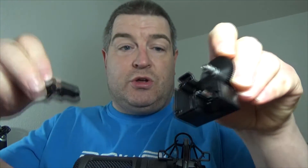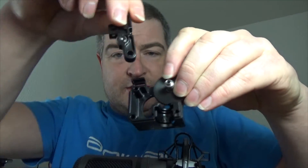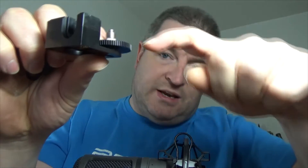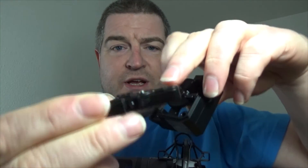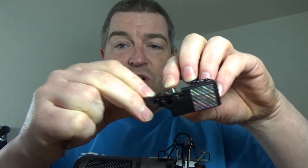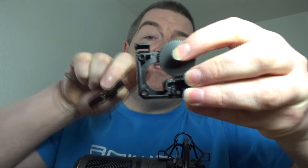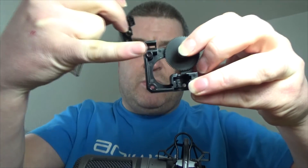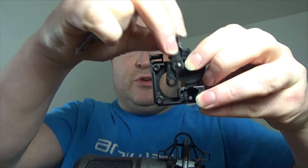There's a slot here for a tension screw and the idler arm. If you can imagine, the stepper motor pokes to the back, and the stepper motor gear from this little bag goes onto the stepper motor shaft. It needs to be level with this face — it can't stick out any higher, so there's a little bit of setup to do. This arm has a bearing in it, and the pin sticks out higher on one side and is flush on the other. The flush side rides against this cog. Basically, you have the stepper motor drive sticking through with the cog on, this hole goes on the end of the drive, and applying force to the tension adjusting arm applies force to this.